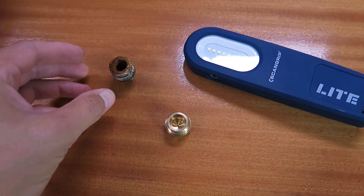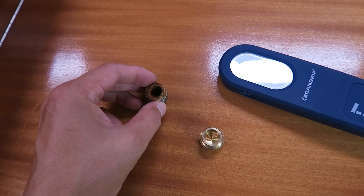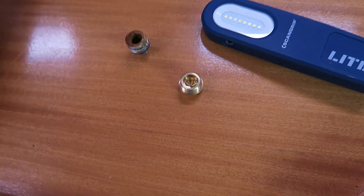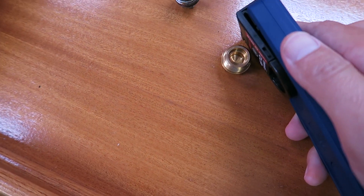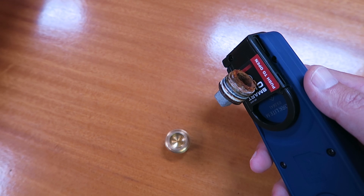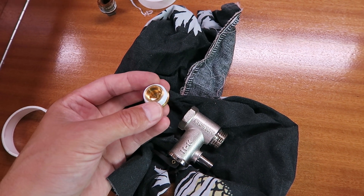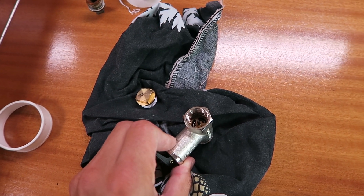Here we have the old plug made of galvanized iron and the new one in brass. The difference between these two plugs is this one isn't magnetic — as you can see, this one is sticking to the magnet, so it can also rust. Around the plug I have used some normal Teflon tape to make sure it is watertight.